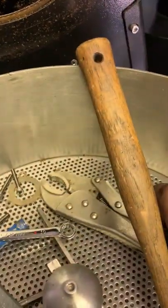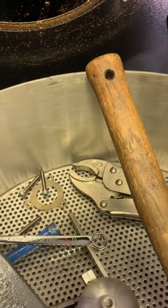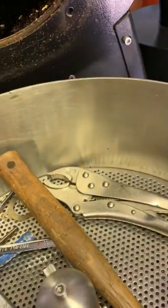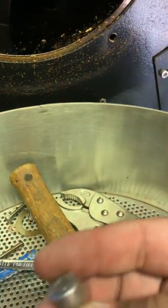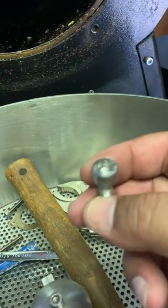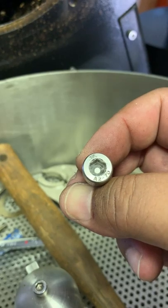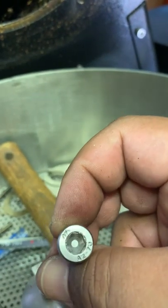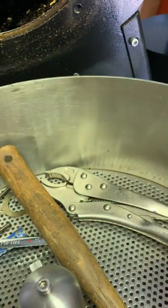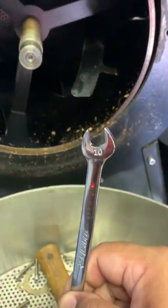In my case, I had to loosen them up a little bit with vise grips and then untighten them by hand little by little — and it worked. Later on I'm going to try to find the correct measurement for the threading on these hex screws and probably order some bolts with a hex head instead of allen wrench screws, so it'll be easier to tighten and remove with just a regular wrench.